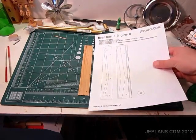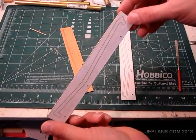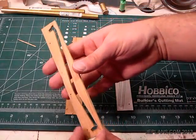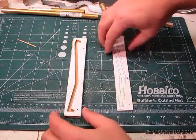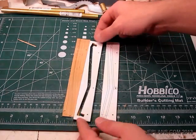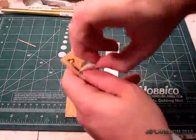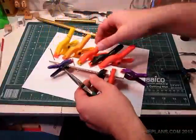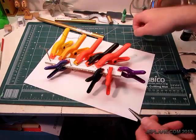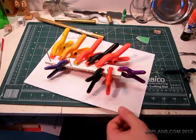Now I will just do the interior pattern on the middle thicker piece. This is the interior pattern attached. I am going to cut out the wood here, then line them all up, glue them all together and cut out the final profile. Obviously I will take this tape off. I glued the layers up and used a couple of drill bits - I could have used a sixteenth of an inch tube as well to line it up with the holes. I am going to pull those out before the glue dries so I can clean them up.